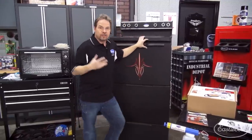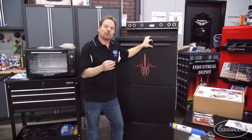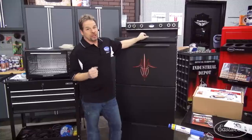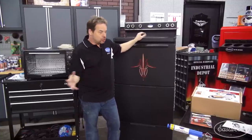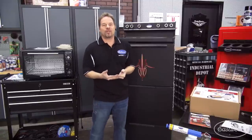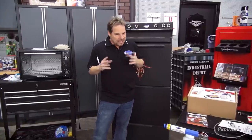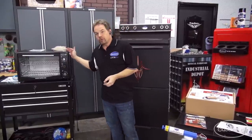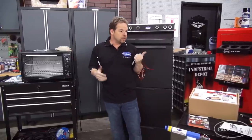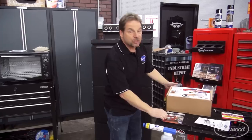This is a neat way to powder coat. I can coat big parts in here, I can preheat, and I can cook them. This uses an extraordinary amount of energy to heat the part up, and let's face it, it's probably not the best seal on this part. So in the spirit of conserving energy or not using as much electricity, it's another great reason to use an oven if you don't need a source that big. If you need something that big, well, creativity is your only option.